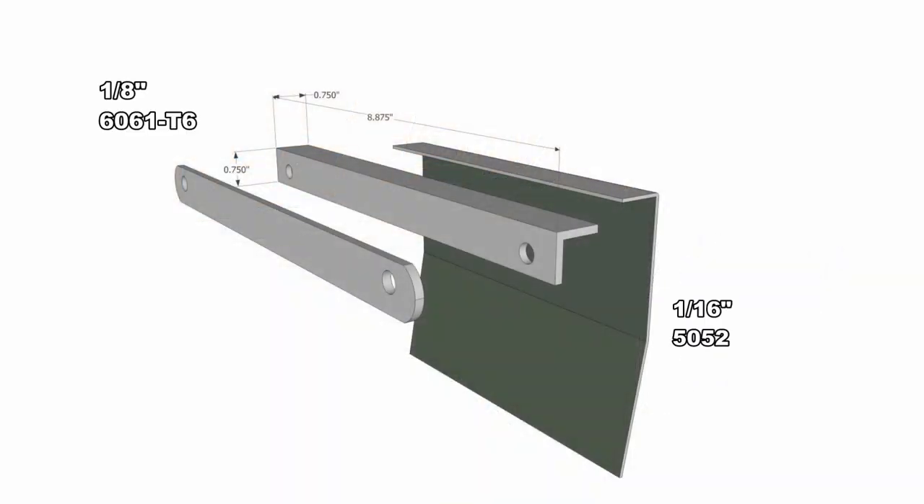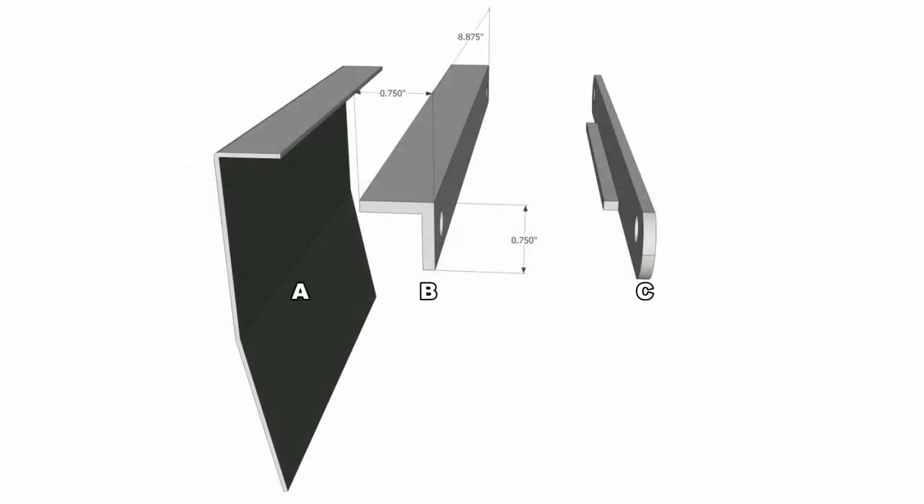Here's what I'm going to make. I need two pieces of 6061 T6 aluminum, one-eighth of an inch thick, three-quarter inch angle by about nine inches long, and a small piece of one-sixteenth inch aluminum, probably 5052. One piece of angle, marked B, will be inside the sliding door providing the strength and integrity. The second piece, marked C, will be mounted on the outside of the door panel and will be the only part you'll see. I've cut back the flange on this piece to allow it to fit into the door opening and to provide a smooth surface for your fingers.